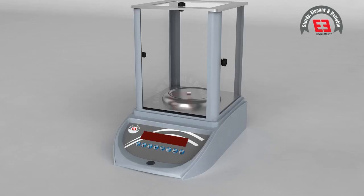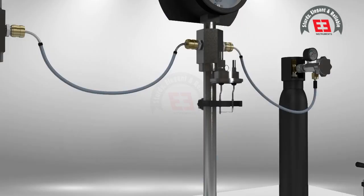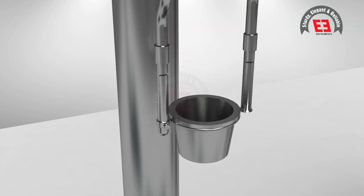Accurately weigh the pellet in the analytical balance to the nearest 0.1 milligram. Also weigh the crucible to the nearest 0.1 milligram and place the prepared pellet into the crucible. The ignition wire of 6 centimeter length or 5 milligram weight is connected at both poles of the bomb.